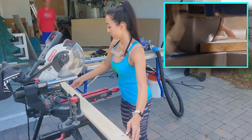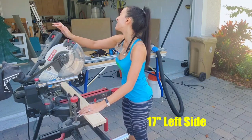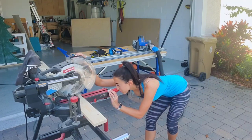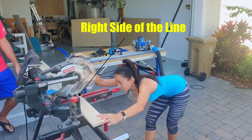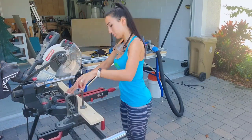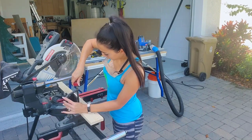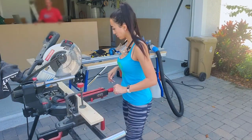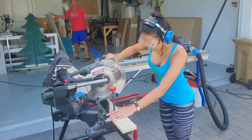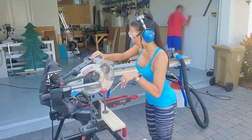The circular blade's thickness can usually vary around an eighth of an inch. Therefore, you want to eye up the edge of the blade's teeth to the outer edge of your line. In my case, I measured 17 inches on the left side of the wood, and I lined up my blade to the right side of the line. Once you have that set, clamp your wood down. I always recommend using safety glasses and earmuffs when working with power tools. Start the chop saw when it's at the open position because there can be kickback, then carefully cut all the way through the board. Keep the chop saw down and release the trigger to activate the brake.